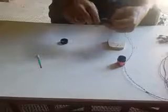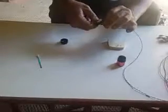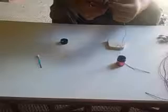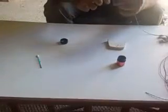Then you place your heatsink and the back of your LED light together. Take your wires and line them up with the fins on the heatsink and twist them together so the wires tightly bind the LED light to the heatsink. Then you run your wires down your bicycle spoke, twisting them so that your wiring stays on the bicycle spoke.